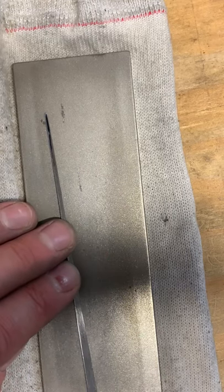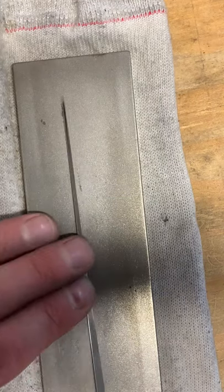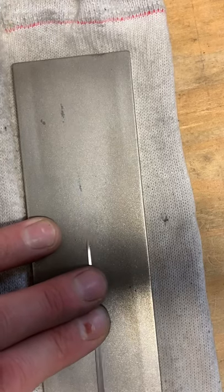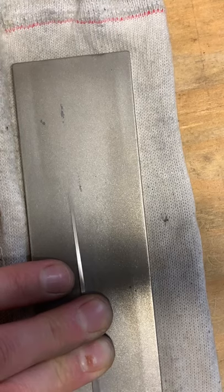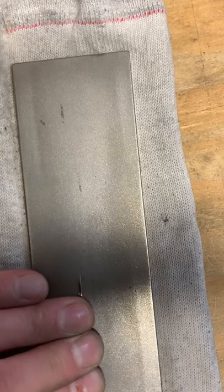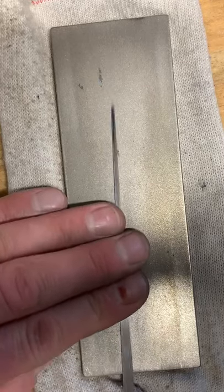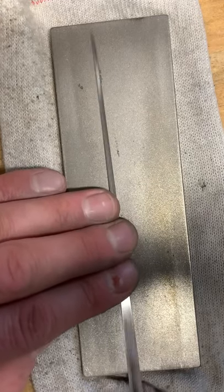Here's my angle. I'm following my angle up and then I'm coming over perpendicular and rolling over the backside. But this backside has no bevel on it. I have a very microscopic one just from the way that I hone it. I'll do it flat real good, I try to polish out my scratches. Rolling it back and forth, I'll actually roll it over perpendicular and over the back.